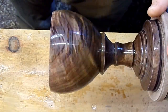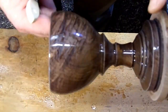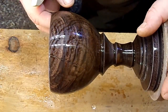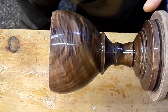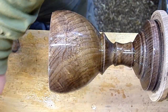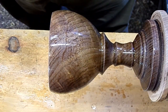We're back, we're sanded. I used 600 and did a wet sand. The inside is what really needed it, more so than the outside, and I went pretty far down on the inside. The outside really didn't look like it needed much, so I used 1000 grit on it. So let's go ahead and we're going to put a thin coat on again, and then see if we need a final.